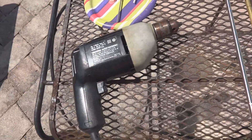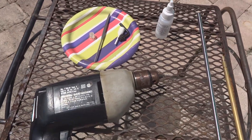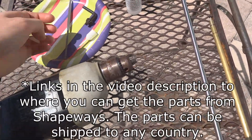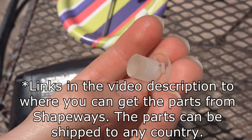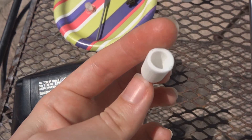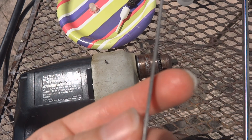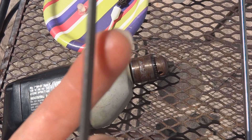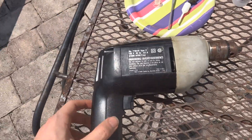Let me show you what you're going to need to cut the ring. If you don't own several thousand dollars of machining equipment, you're going to have to buy a few parts off Shapeways: you're going to need the AEG KC02 barrel cutter and the AEG barrel drill adapter. You're also going to need a very small file with a width of about one and a half to two millimeters — anything smaller than that will not work, and you could probably use something bigger but I'm not sure about the performance. You're also going to need an electric drill.